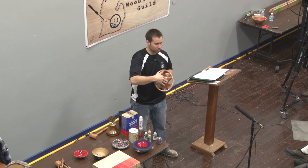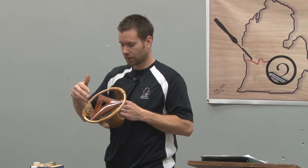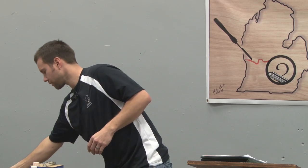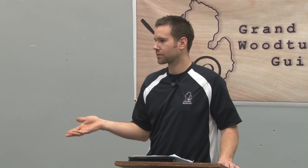It's a great way to accent a boring piece or make a cool piece even better. On this piece here, I just wanted the inner part darker so I used a mahogany TransTint dye and hit it — this was a whiter bowl and I just wanted the inside to pop. I also used it on a tabletop in my basement: a piece of Sapele veneer I wanted darker to look more like walnut. I covered the tabletop with TransTint dye and with the curly Sapele it made the grain really pop. The possibilities are endless.